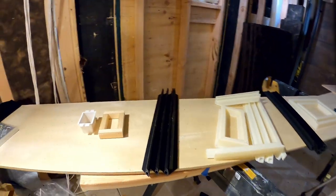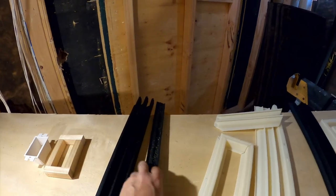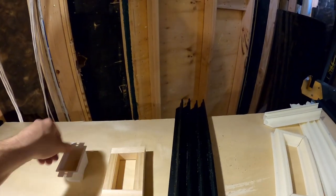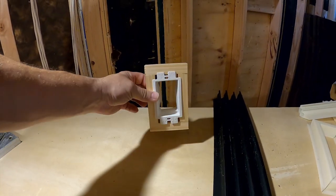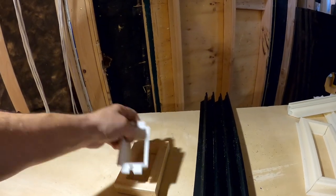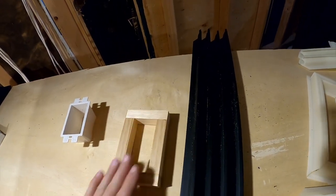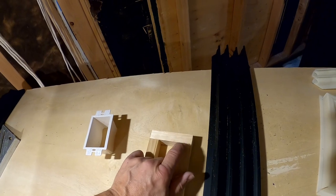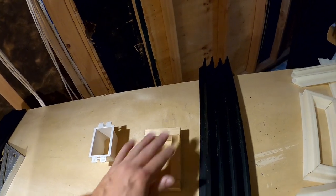So a quick update — I obviously wasn't going to show you me cutting all of these. This is our panel number one: four even 20-inch perimeter panels. This is the piece of wood blocking for the outlet — that will mount to the wall, and you may need a box extender depending on your outlet. A couple of quick notes: when we do these, the face of this wood panel has to be perfectly smooth. We'll take a belt sander or a sanding disc and keep this completely smooth — the fabric can pick up little wrinkles of less than a sixteenth of an inch fairly easily. So keep that in mind.